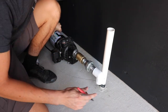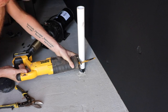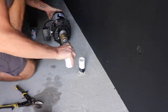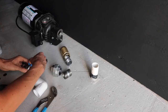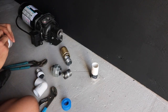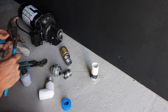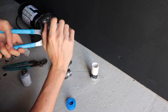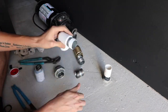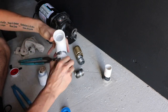The union is really important — if we ever have any issues with that well pump and it needs to be replaced in 10 or 20 years, I'll easily be able to get it out of there. The check valve is really important for keeping the pump primed; if it loses its prime, meaning air gets into the pump, it just doesn't work very well. I basically modeled this after different well systems I've seen — from the rainwater tank onward it's very similar to how you would plumb up a standard well setup.